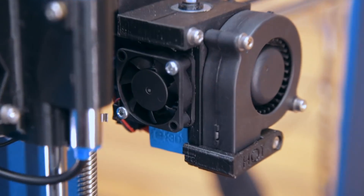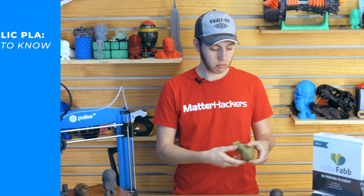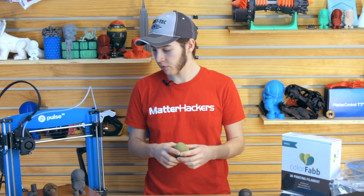If you try to extrude it too quickly, rather than chewing through the filament, it'll snap and you'll have breaks within the Bowden tube. For layer cooling, you will want to have a fan — it is PLA, so overhangs are going to be more problematic without a layer cooling fan. You can see on this brass fill piece that if you have poor layer cooling, it shows under the backside. These all look great — I printed these on a Pulse, which had a hardened steel nozzle.